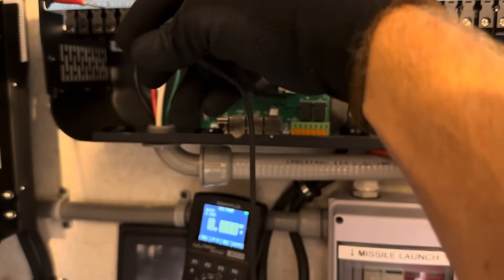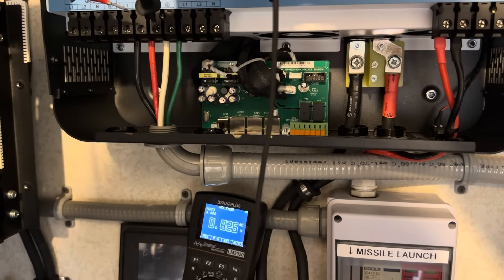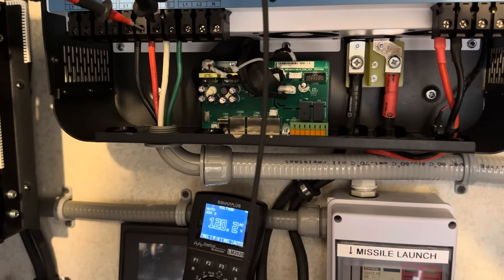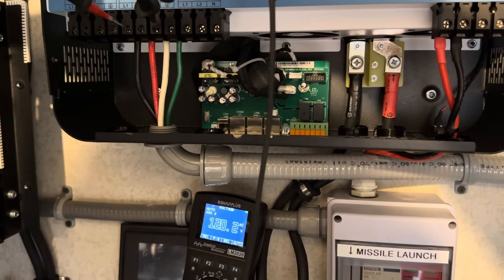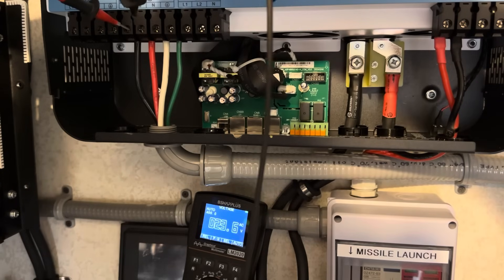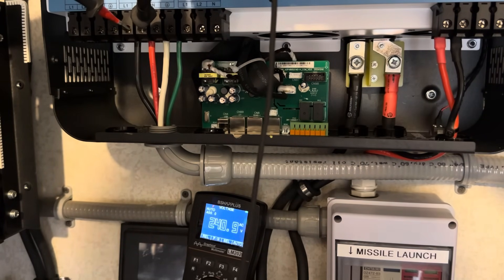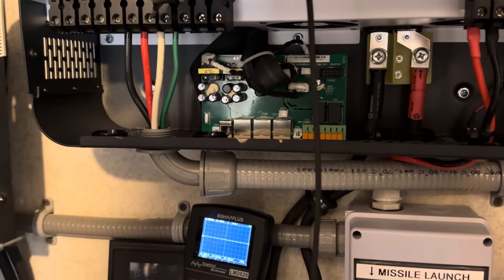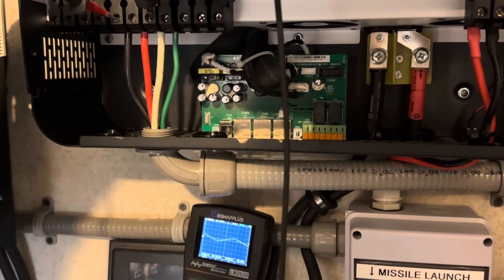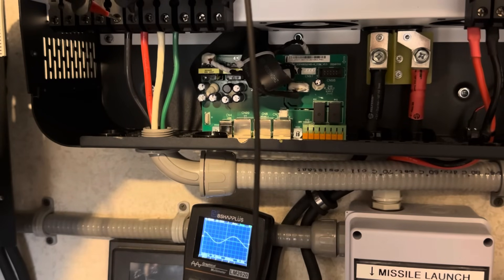Each of the PV inputs on the inverter are capable of carrying 18 amps. SunGold recommends 12 gauge cabling with a 25 amp two-pole breaker. As soon as you power up the inverter, it is already in 120/240 volt split phase mode — you have to go in and reconfigure if you want straight 120. I've got it selected for 120 volt. You can do 127, 120, 115, all kinds of different options. Neutral to L2 reads 120.2, neutral to L1 reads 120.2, and L1 to L2 reads 240.9. The inverter is pure sine wave. Here's L2 to neutral, L1 to neutral, and then 240 volt L1 to L2.